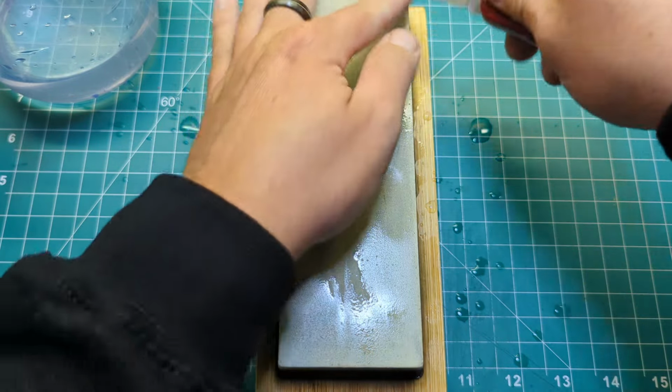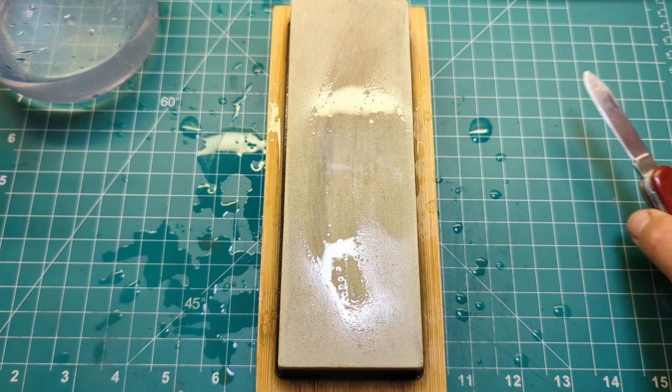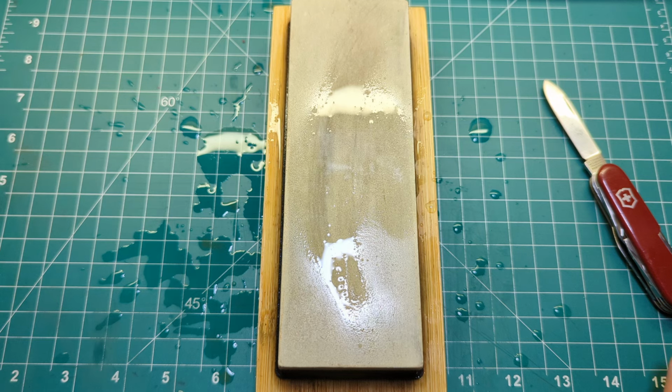20 to 25 is pretty much where it's at. For a working knife, I found the edge lasts a lot longer than anything less. But I mean, if you like a less angle, and that's what you enjoy, crack on. Don't let anyone tell you that it's wrong or anything like that with any aspect of your life,